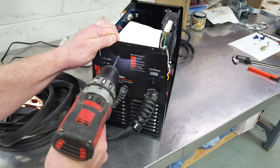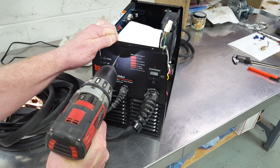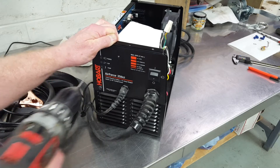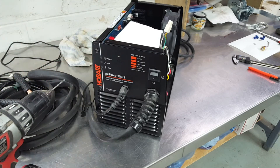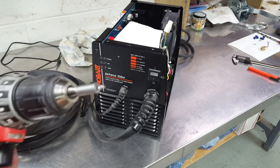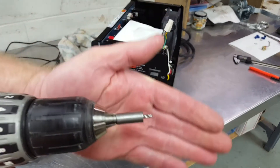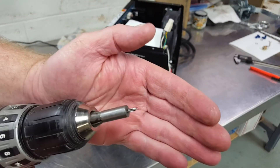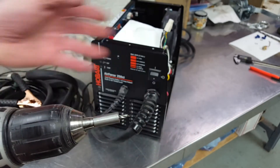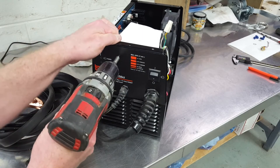With the split clamp done, it was time to drill a hole through the front of the Hobart Plasma Cutter so I could mount my quarter inch microphone jack for my interconnect cable. If you look real closely, you'll see on my drill bits that I use a series of tubes or spacers to keep the drill bit from plunging deep into the enclosure of the Hobart. I also packed the front of the Hobart with some paper towels to make sure that metal chips wouldn't start floating around inside and getting places I didn't want.